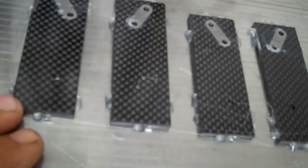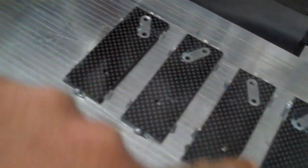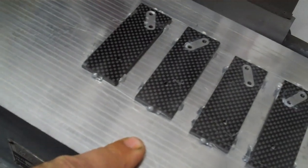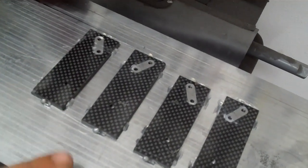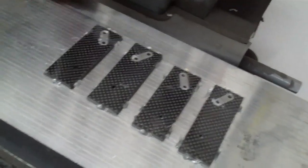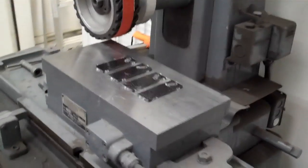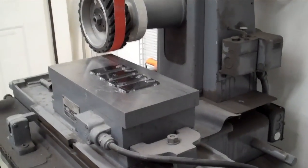Since we're in overkill mode on this knife, I figured why not use my surface grinder to clean up the insides. Everything's glued down on there — typically I wouldn't glue these directly to my plate, but I wasn't thinking real clear this morning. These are the plain carbon fiber handles and I've hot-melt glued a bunch of spots around the perimeter of them directly down onto my magnetic plate. Usually I would use a subplate and glue to that, but this step isn't strictly necessary. I figured this would be a good demonstration of the belt conversion on the surface grinder.